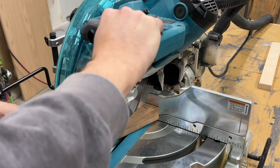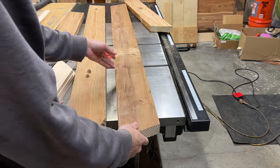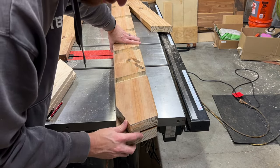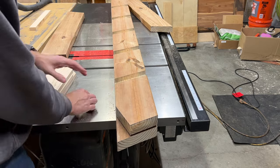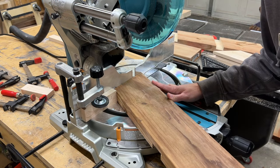With the stair slots done, I'll make the last cut at the top which creates the angle for the ladder to attach to the swing set. I'll trace the angle onto the other side, remembering to mirror it so that it's on the correct side, and then make the cut. I use my CNC table off screen to support the other end of the stock while making this cut.